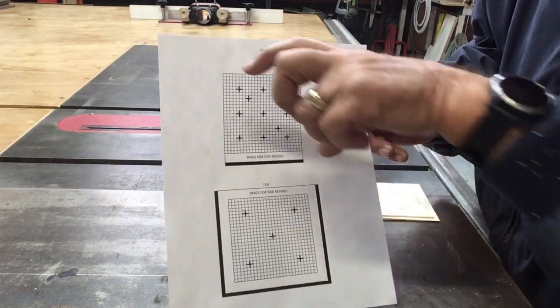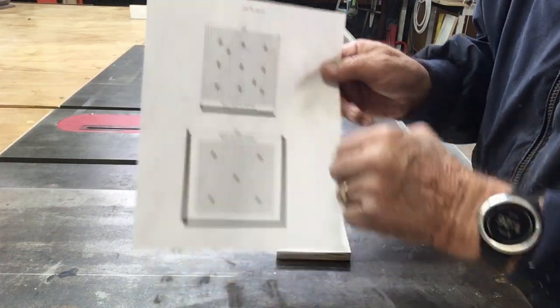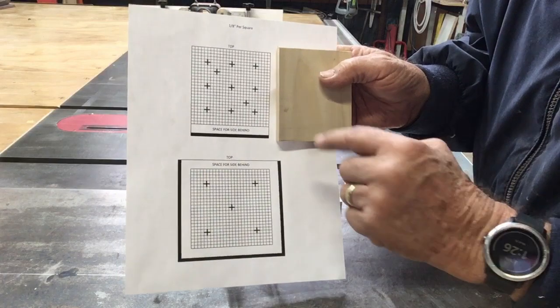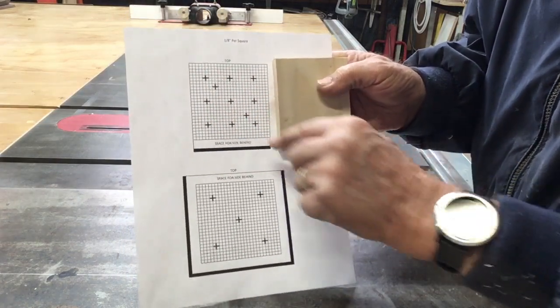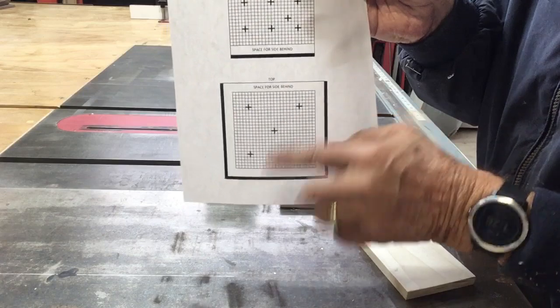I had built one before that. The two was far apart and I didn't like it. So once I get this, also when you make this design, you have to remember, you have to deduct for the eighth of an inch, 3/8 of an inch down here. So you can square this up, you gotta come up 3/8 of an inch. Once I have, this is for side number 1 and 4.